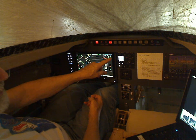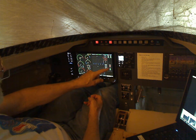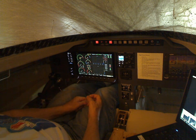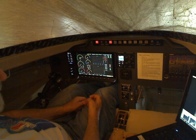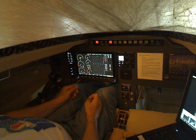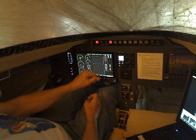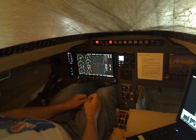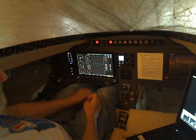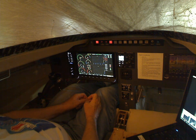These four lights are actually green right now except that one which is red. These two indicate the header tanks, which hold about a gallon each of fuel — we've got left and right fuel systems. The header tanks hold the last gallon of gasoline. As long as they both say full, everything's fine. But if one turns red and says 'hazard' instead of 'left header,' I know I've got a real low fuel situation on that side.